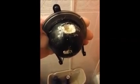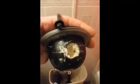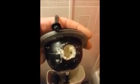What I ended up doing was filling the hole with expanding foam. The foam is just going to keep the air from rushing out real fast to give it that extra two or three seconds of flush. It doesn't need to be pretty - no one will ever see it but you. I went with foam because if you put tape or anything else, it may potentially break off and enter the toilet, and if it gets to one of the small holes and clogs it, it's done - you'll never get it out.